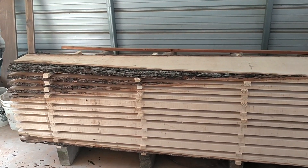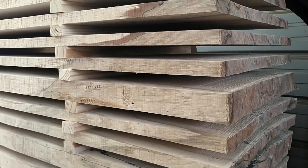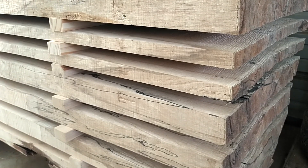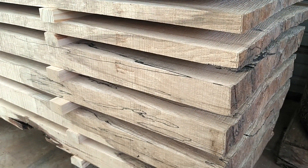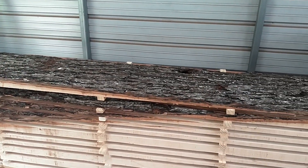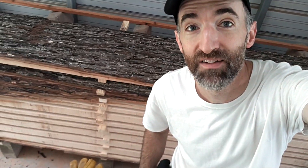The top one right there may only be about half usable — that's okay, we still get plenty of good lumber on this side. The one-inch slabs are going to take about a year to air dry, and the two-inch slabs are going to take about two years or more. If you want a quicker process you'll have to get a solar kiln. To keep the top board from warping I took one of my first cuts that's really heavy and stuck it on top. If you're thinking about getting a sawmill I'd probably suggest doing it, but first make sure you have the room not only for the sawmill but for the storage for all the wood — because it's going to have to sit there for a long period of time to dry out. Otherwise, get out there and cut up some wood.